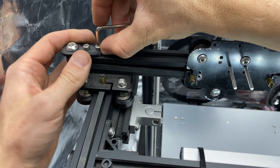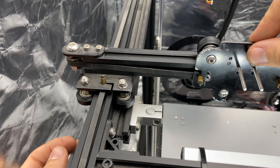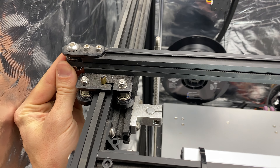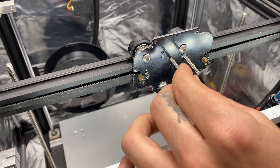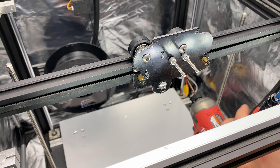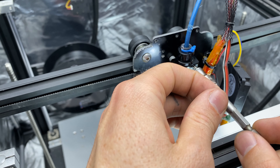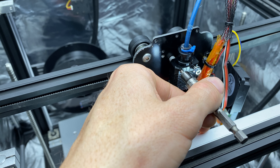One of the main reasons I went through the effort of building the new X carriage out of metal is because the new Spyder hotend is meant to add capabilities to this workhorse of a machine. Due to the stresses on the X carriage, I don't think a 3D printed part would last in this situation, especially considering high temperature filaments and heated enclosures. If you end up purchasing the HBE X carriage kit off of eBay, it comes with everything you need to install the Spyder hotend. I'd recommend purchasing the Spyder hotend first, then the X carriage kit, and go into Thingiverse right after your purchases so you can print out the fan shroud. That way, you've got everything ready to go by the time all the parts arrive in the mail.